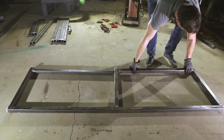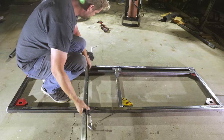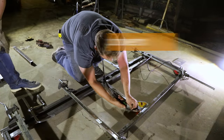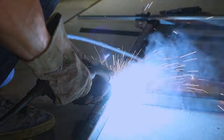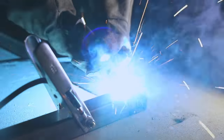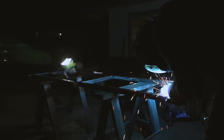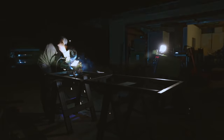I mentioned I hadn't welded in a year, but I didn't mention that was actually my only experience welding — so I was basically back to square one. Fortunately, I had Eric from Cutworks there, an expert welder, to give me a crash course. I started by tack welding the corners of each joint, which holds the structure together but still allows you to adjust anything that's out of square, then ran a full bead across each seam. Going slow, I was working late into the night and decided around midnight to call it and finish the next morning.